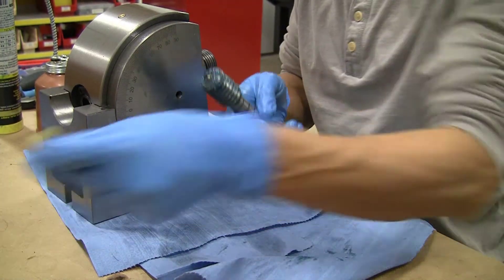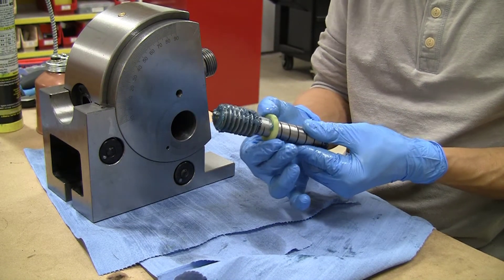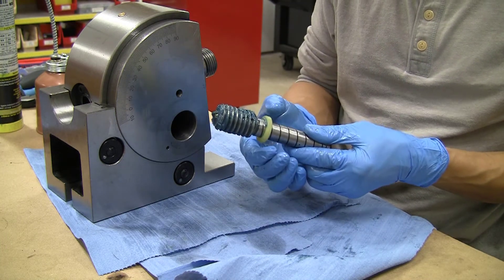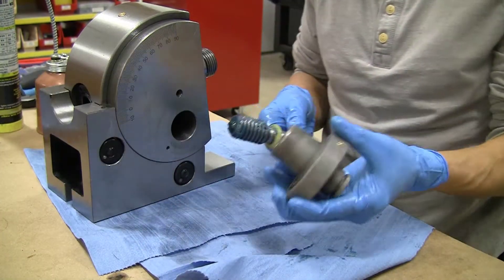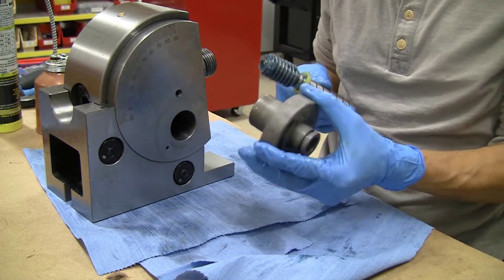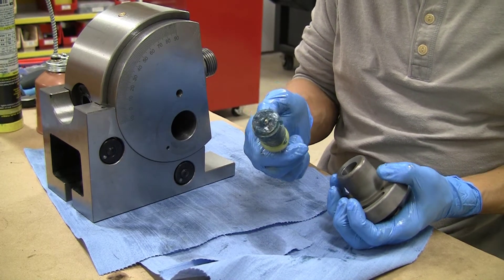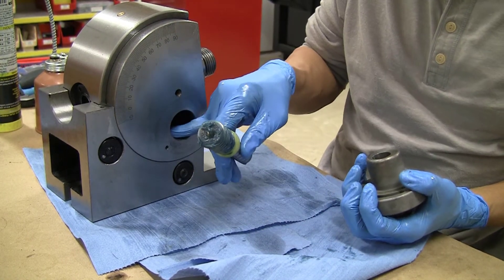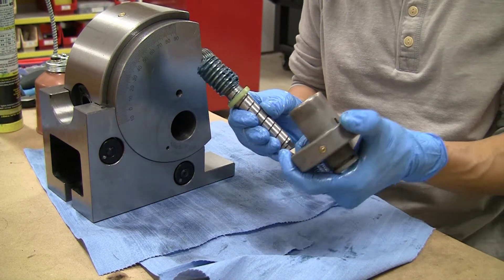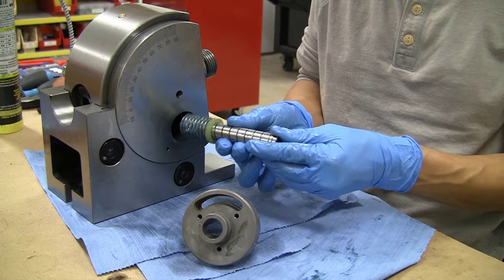Next is the screw for adjusting the backlash between the worm shaft and the worm gear itself. Now for the worm — it has a nylon washer that goes in, but it was giving me a lot of trouble when trying to reinstall the mounting bracket. The washer is just a little bit too big, and when you put the worm shaft into the mounting bracket it would catch just inside. The solution was to make sure the nylon washer was fully in towards the worm, and then the whole thing was able to go in without too much trouble.